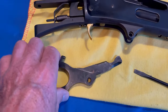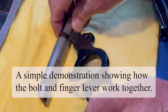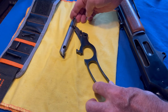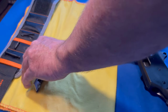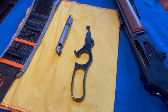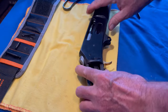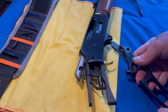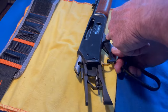So the upper portion of the lever goes into the bolt. There's a slotted opening in the bolt — the lever goes in here. As you cock it, it moves the bolt back, and then the lever pulls the bolt forward. To show you the orientation: move that forward just a little bit, slide that up — this gives you an idea of what that's about.